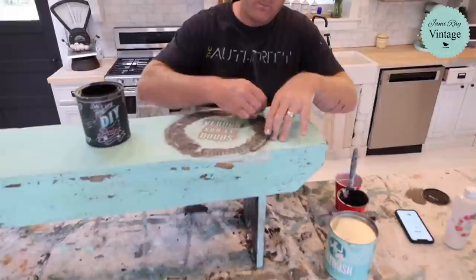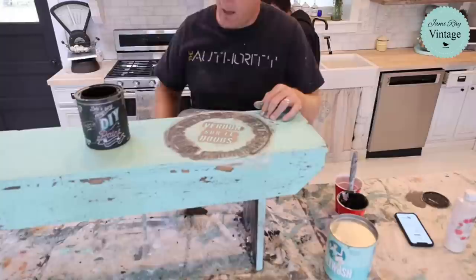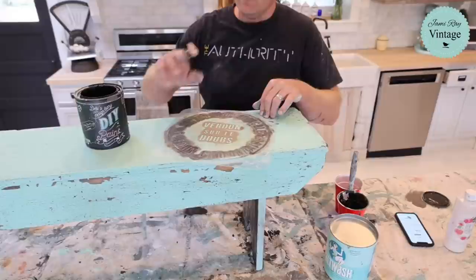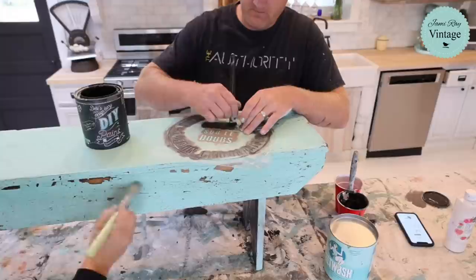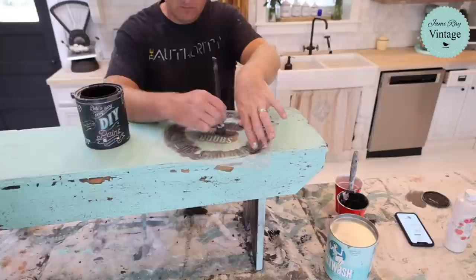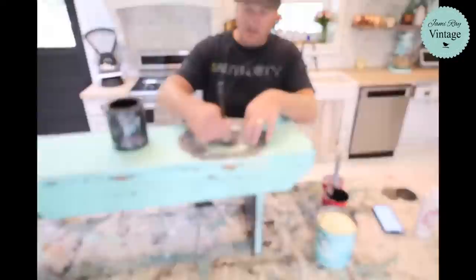There's a link in the description to our website — I don't have individual product links yet but they'll be in there later. If you just go to the DIY or milk paint section you'll find Summer Cottage and Weathered Wood easily. I'm using one of our prototype stencil brushes — stencil brushes do work well as wax brushes. There are still big flakes and I'm just going to leave them because I want it to look super old and authentic. The milk paint doesn't change color a lot when it dries.